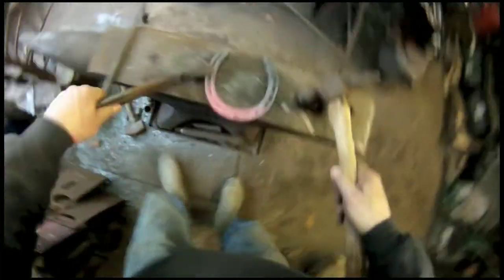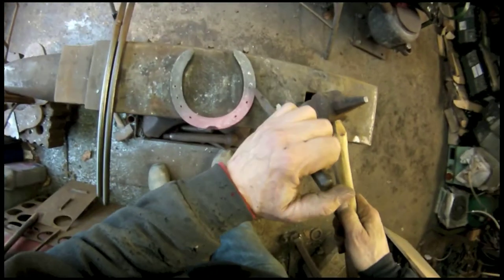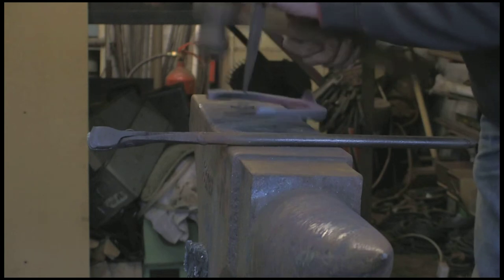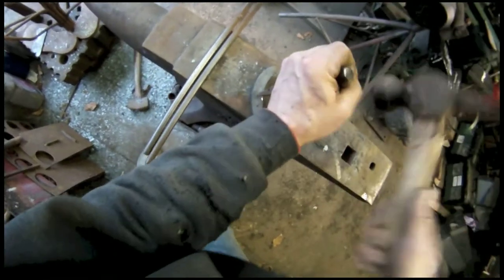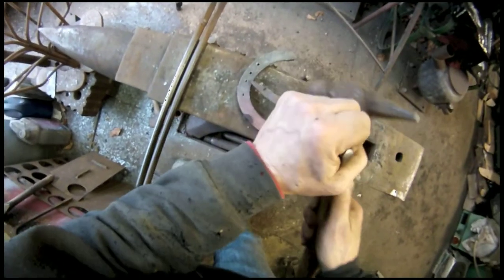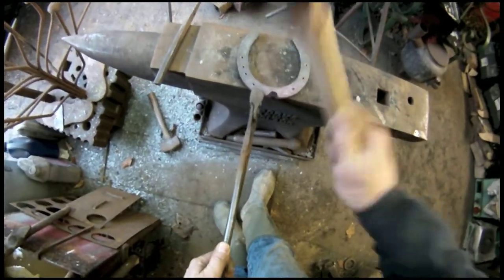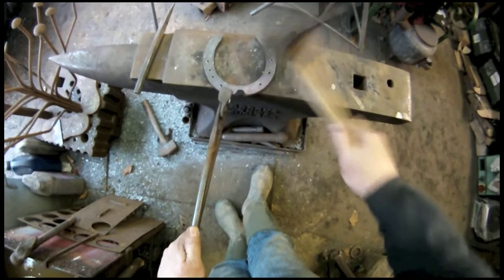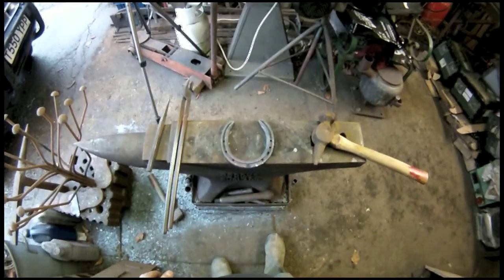Just tidying it up, making sure it's not distorted, try and get it pretty even, just making a generalised shape. Now back to the bridge — we'll just clean out the holes, make sure they're nice and — well they're not actually square, they're oblong. They're the shape of the shank of a nail; if you were to cut the head off a nail, what you see is the shape of the tools that I'm using — the stamp and the pritchell, both should be that shape. And there you go — one front shoe. Nothing special, but thanks for watching.